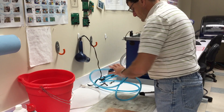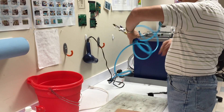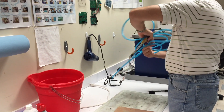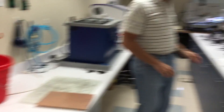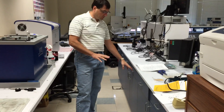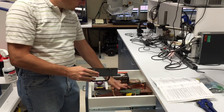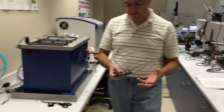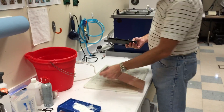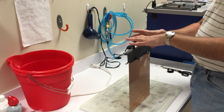We'll make sure we put the tools back and leave the lab in a state that's better than when you found it. The holders and all the tools for the plater are in the same drawer. The plater holder we're going to use first is the plastic one — later we'll use the one with the cable, which is the one used for actual electroplating. This one is just for holding the board through the cleaning stages. We're going to mount the board into the holder, lightly tighten down the thumb screws, and put the board into the plating baths.